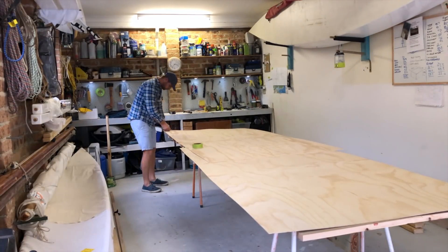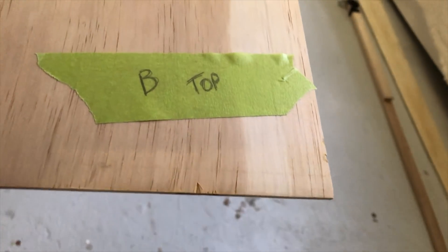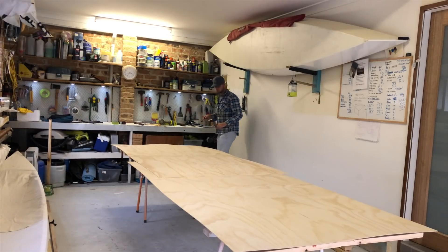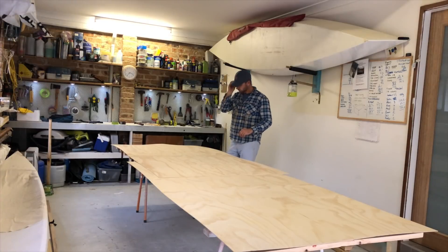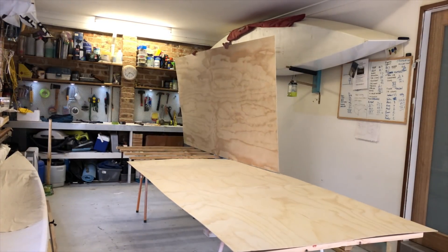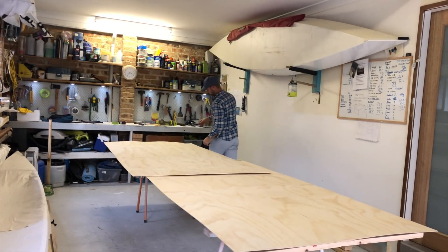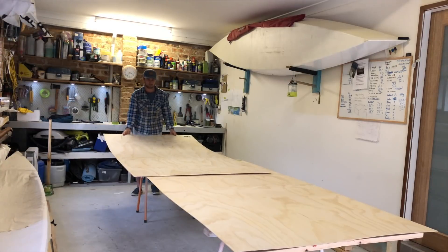From here I do the same with Panel B — look at the sides, put some sticky tape down and mark it with a B. Now before we get into scarfing the timbers, we want to put the two good sides together. That way after the scarf is cut and you flip them over to join them, the two best sides will be face up.